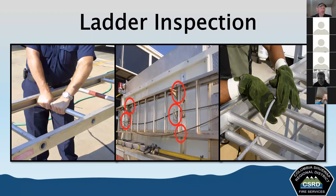On roof ladders, inspect the hook assembly — it should operate easily with no rust, no deformation, and all parts firmly attached. On extension ladders, check the pawl assembly to make sure it can hook, inspect the halyard cable for damage and wear, ensure the halyard is taut when bedded (a loose halyard causes more friction and wear), and verify that the pulleys turn freely. If any discrepancies are found, remove that ladder from service until it's tested and repaired.